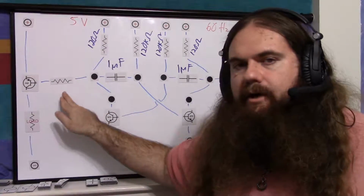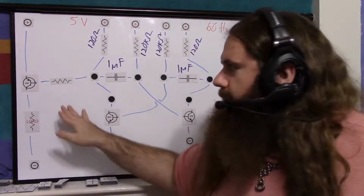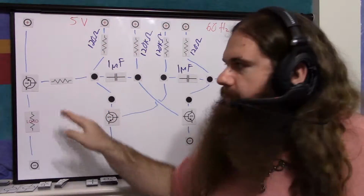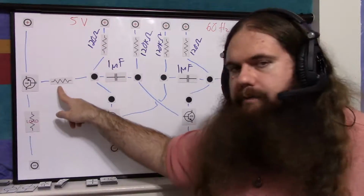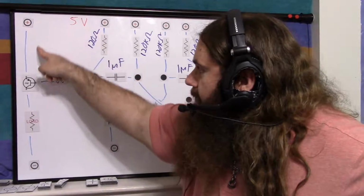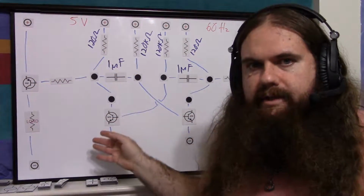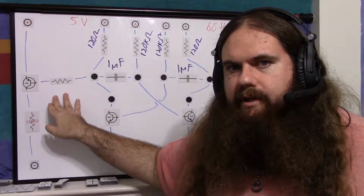So if you turn this down way, way low, it actually changes the timing of the whole thing, but you don't need much. You can turn it up just fine, and we don't need that to be high, and we don't want this to be high current anyway. A bigger resistor here is good, because again, this is wasted current. We just need it to turn the transistor on. Less power wasted is great. So having a higher resistor here is not a big deal.